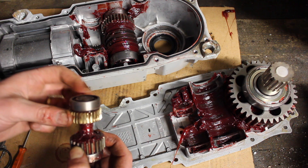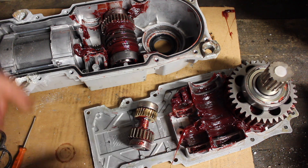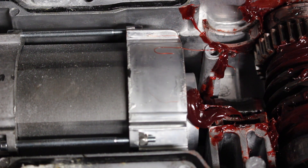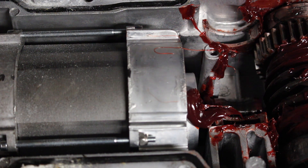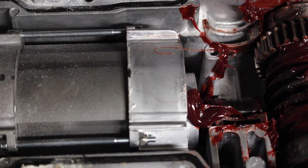It's next to this brass shaft which has a brass gear that looks to be somewhat damaged. I wonder if something was causing heat or vibration here that has caused the wear. I think we might try and run the motor again with nothing attached to see how it sounds. That still sounds rather rough with nothing attached and no load on the motor, which leads me to think there's something wrong with the motor itself.